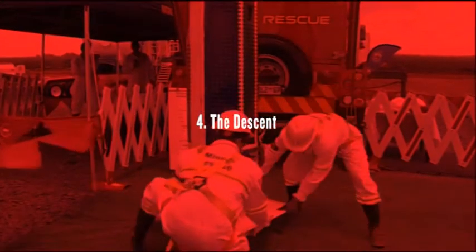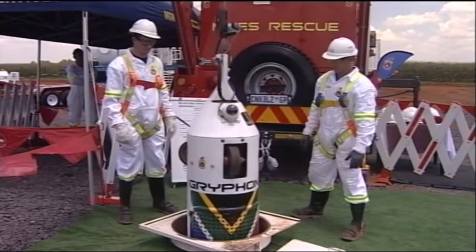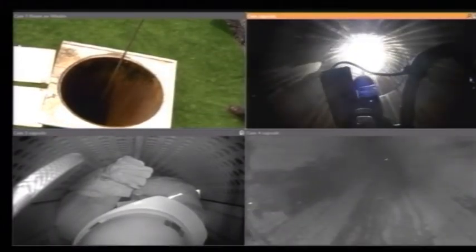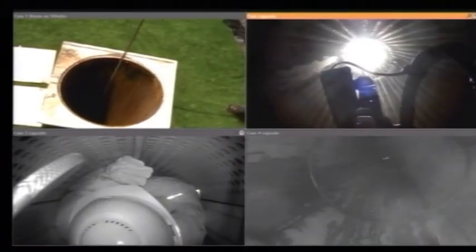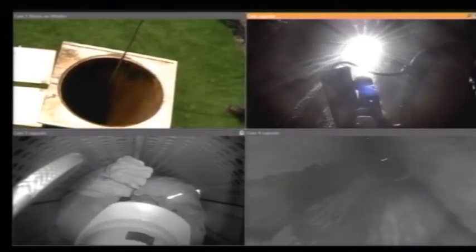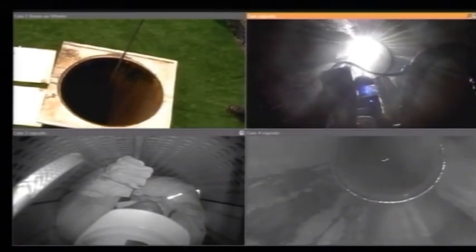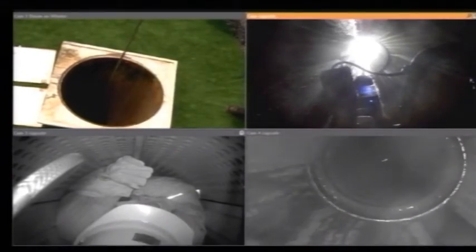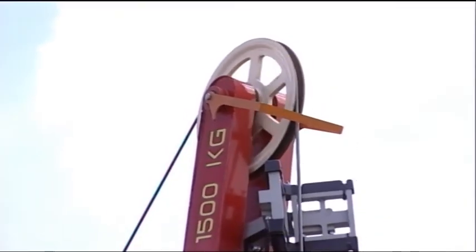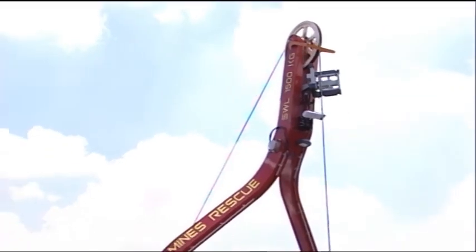You will now note that they will raise the capsule slowly, they will open the hole, and the capsule will now be guided into the hole. This unit has got all the safety devices, the same as any winder on a mine. It has got its first three-turn slowdown safety device. The maximum speed we can reach is 0.5 meters per second, but we go down this hole at 0.35 meters per second. The rope itself is a 13 millimeter non-spin rope, and the length of our rope is 1,300 meters. This mobile winder has been licensed by the DMR to be operated on any mine in South Africa.